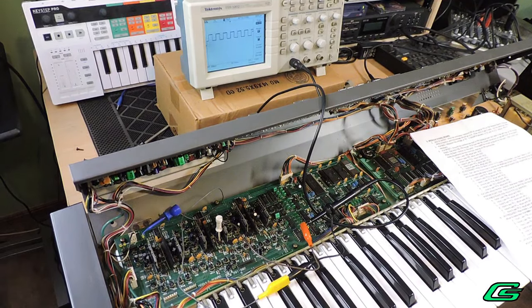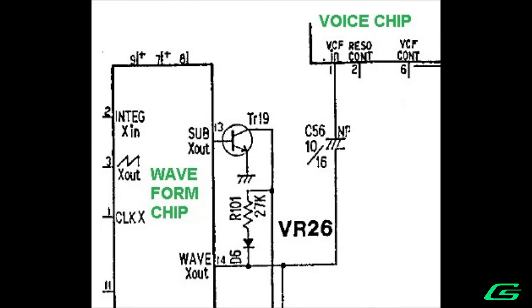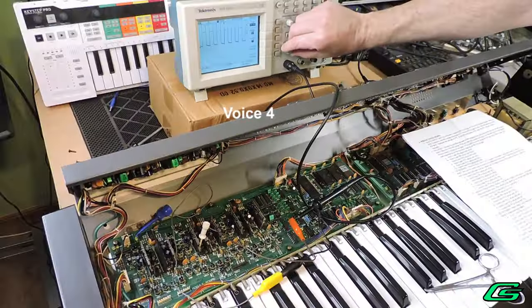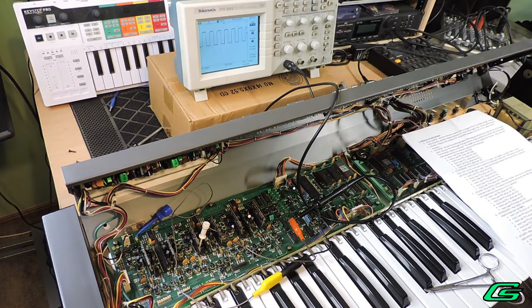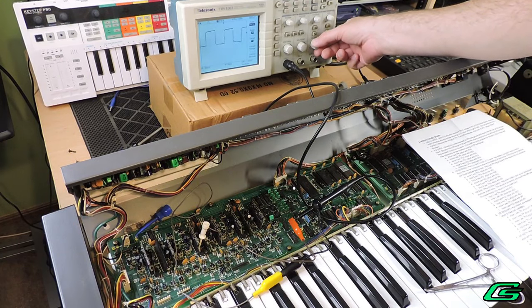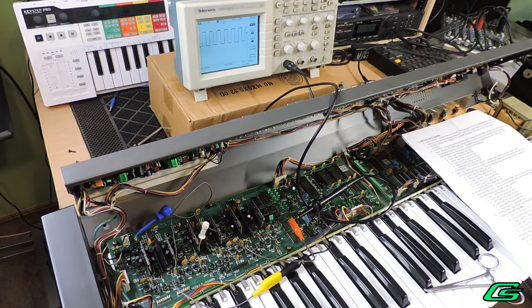Now I'm looking at the signal coming out of the waveform chip. The waveform chip is what takes the clock DCO pulse signal and turns it into the waveforms — pulse, sawtooth, and sub octave generator. The waveform chip in question handles both voice 3 and 4. Since I can't access the chip pin with my probe I've clipped onto the diode that uses the same node. After comparing the output for voice 4 and 3 I see they're not the same. It's possible but not certain this waveform chip might be starting to fail. The waveform chips are dipped in the same encapsulation material the voice chips are famous for. As the encapsulation starts to age and break down it can cause issues with components living on the encased ceramic wafer.